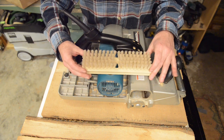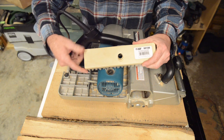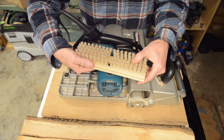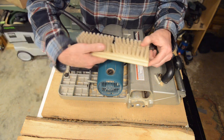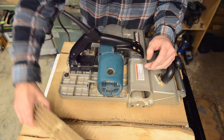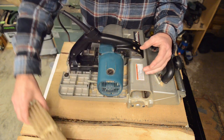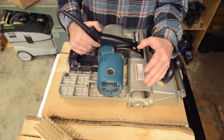I use something like this — I actually have a larger one. It's made for a broom handle; it's very coarse and fairly effective for digging grit out of the timber. I sweep it all down with that coarse one and then use a finer brush on every surface of every timber unless I know exactly what it is.